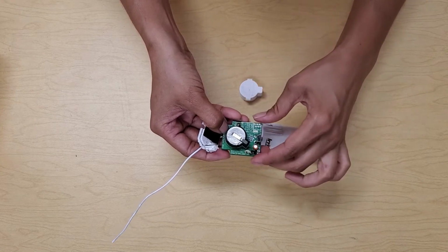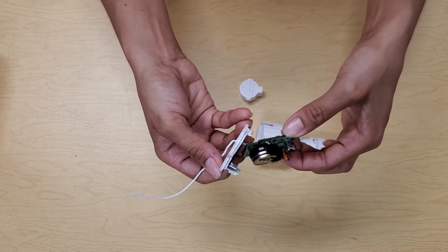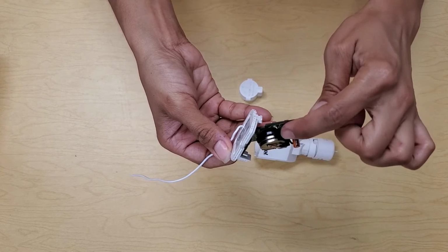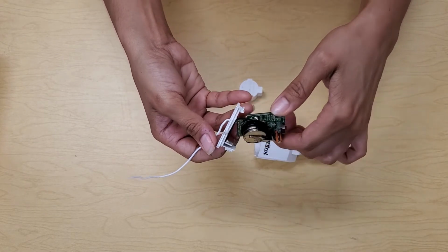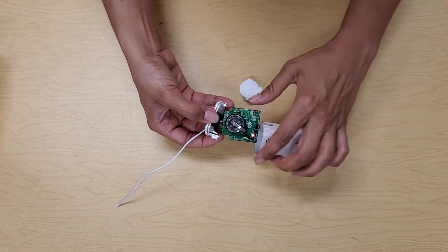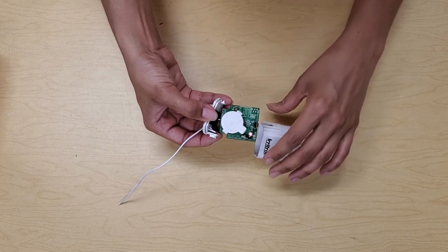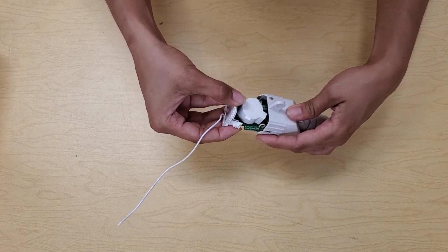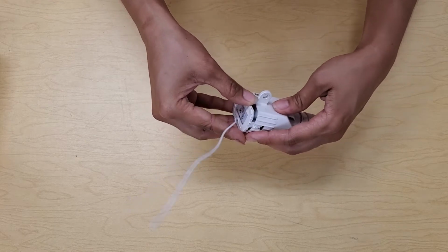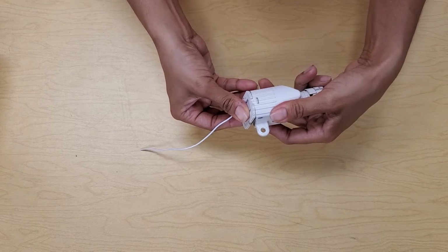The Irritrol RS1000 has 2 batteries that need to be replaced. After putting in fresh batteries, put the battery cover back on. This model has grooves inside the housing to align and reinsert the circuit board. Once the board sits correctly inside, snap the bottom back in place.